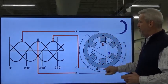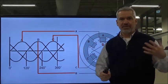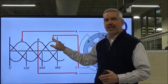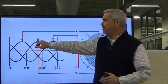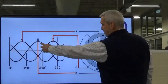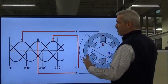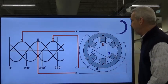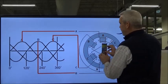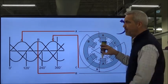Here I've got a three-phase motor with a set of A coils, a set of B coils, and a set of C phase coils. Over here is the three-phase sine wave coming from our power plant into our facility. We know that each one of the sine waves peaks 120 electrical degrees from each other, so as one fades off, the next one is building to its maximum point. We've got A phase going to our A coils, B phase going to our B coils, and C phase going to our C coils. I'm going to use this bottle here as an example of our rotor. As A phase peaks, the magnetic field between the A poles is the strongest, and our rotor is going to be attracted to this strongest magnetic field.